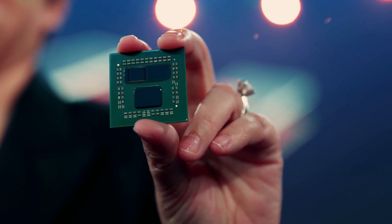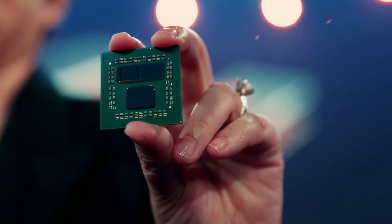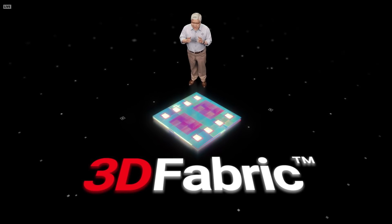The chip Lisa Su showed on stage was a standard Ryzen 5000 processor with its two core complex chiplets — one die with the extra cache and one die without, so you could see what looked like a little bump. AMD clarified that it's a 6mm by 6mm bump, so 36mm² for 64 megabytes of L3 cache. What they're using here is TSMC's 3D fabric stacking technology — technically their SoIC chip-on-wafer technology — using through-silicon vias, so copper-to-copper interconnects between the main die and the cache die. They've had to thin both dies to get that to work.